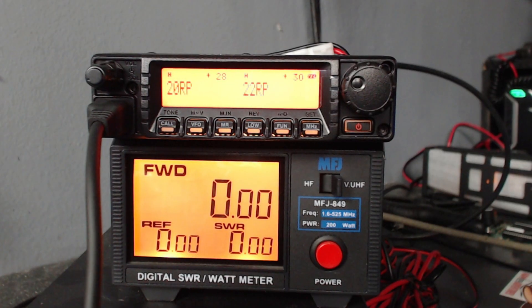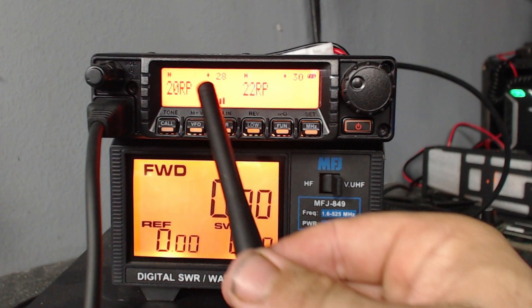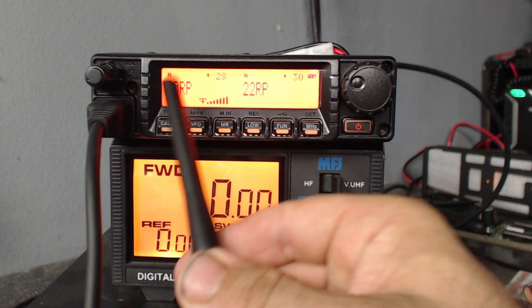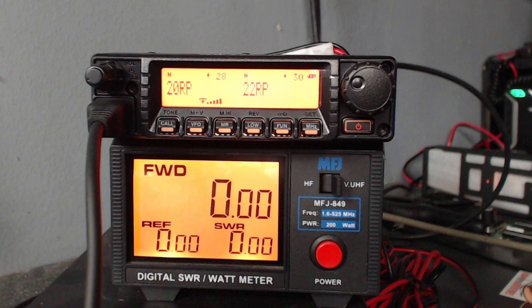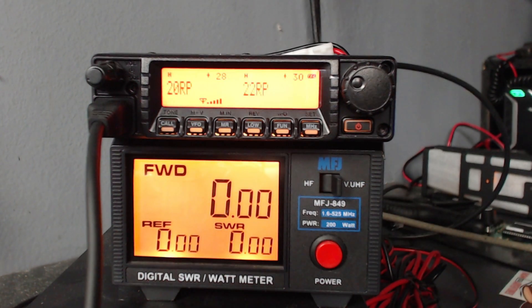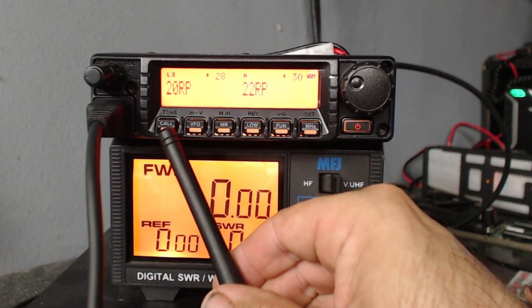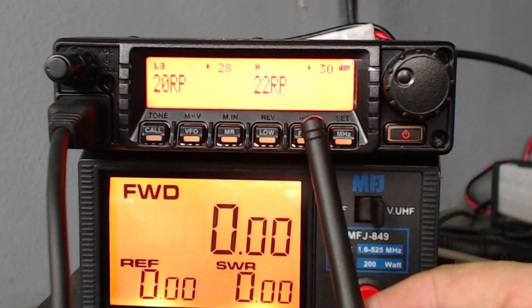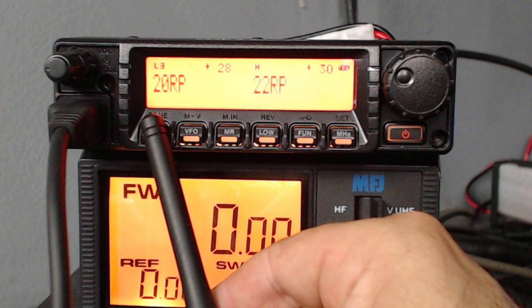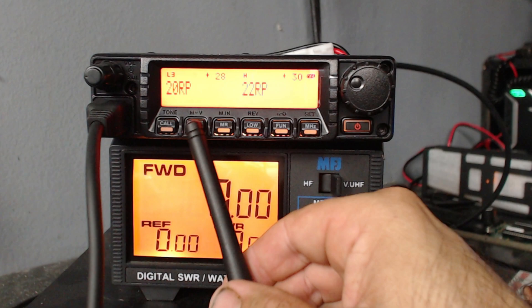Looking at the radio itself, I've got the left side on repeater channel 20. I went in and changed the CTCSS tone to match my local repeater, and I could save that as a different channel inside the radio if I wanted to — I could name it 'Dallas Repeater' or something, while still keeping that 20 RP channel free for other repeaters on the same frequency. These buttons are dual-purpose, as most radios are. There's a call button, and above it is etched into the radio a secondary option — tone above it so you can set your tone. VFO has memory, two VFOs. Long-pressing saves into memory. MR is memory recall.